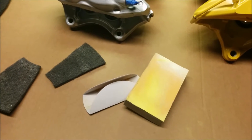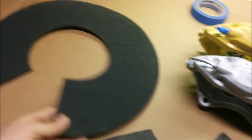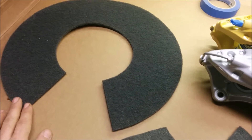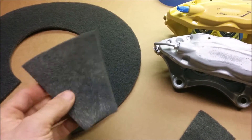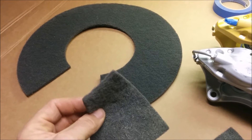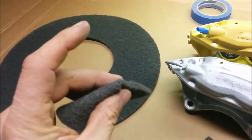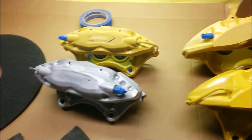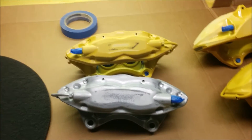After you've gotten everything you can get hand-sanding with the 220 and the sponge, I then move on to this. We use these to abrade between coats on wood floors — it's like a scotch-brite pad but coarser than the normal maroon pad, which I think is equivalent to 320 grit. This one is coarser, and being more spongy it's easier to fold into the nooks and crannies. That's what I'll go over everything with at the very end to make sure I've got a mechanical bond.